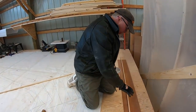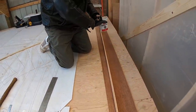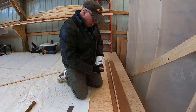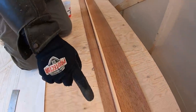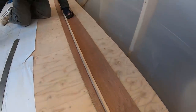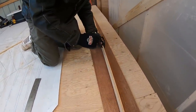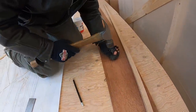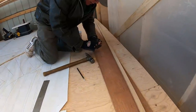What I'm doing here is I've got a piece of wood - just a scrap piece of thin plywood - and I'm going to make a template out of it for the deck. The deck I want to have a camber, not very much camber, about an inch. So what I've done is I've made a line in the center that's up two inches, and then on the ends I've put a line that's one inch up. So there's an inch in the difference. Now I'm just going to lock this in place. It's a bit cold today - that's the reason for the gloves.